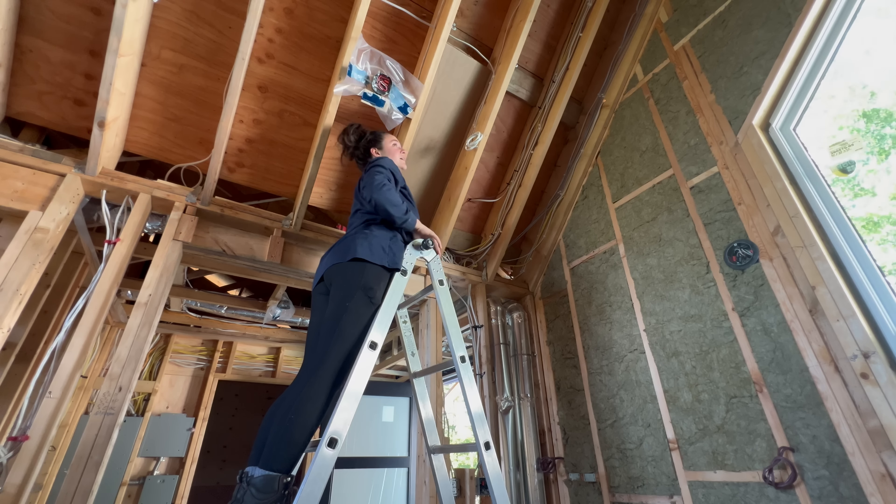Other than that one spot, the walls are officially insulated. There's still so much work left — vapor barrier, acoustic seal. The next step I want to tackle, especially since we're holding an event here in a few weeks, is the ceiling. Like I said, cardboard vents — and I went and bought all of the strapping. But first I need to clean. I've made a tornado of a mess. It's clean now — time to put up rafter vents with strapping and cardboard.